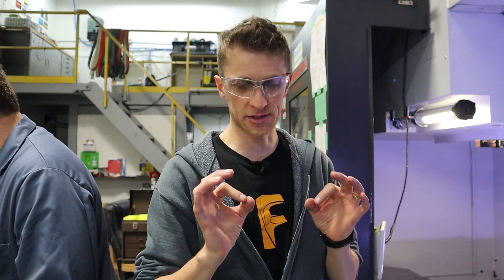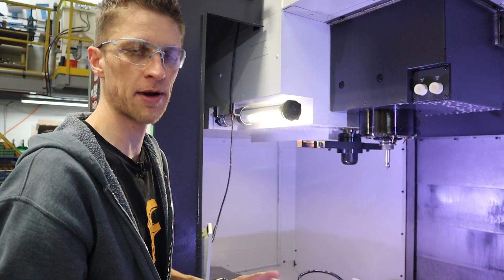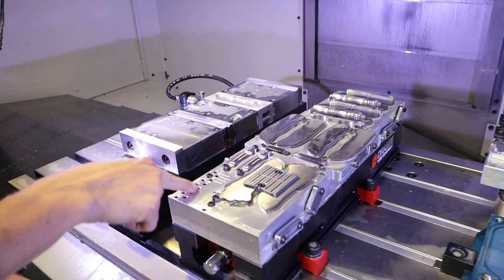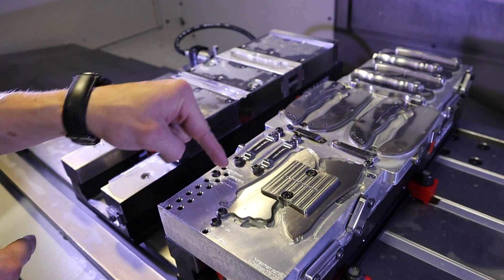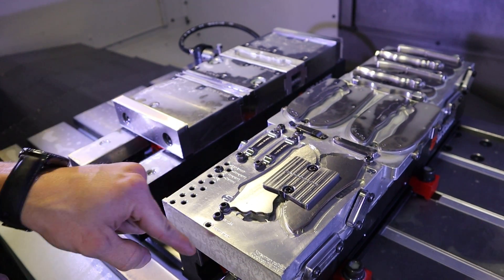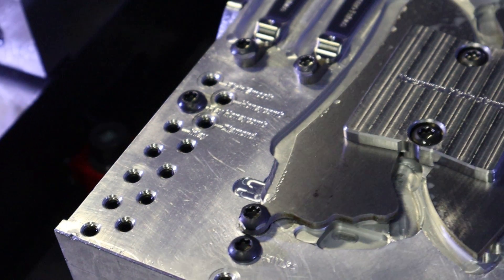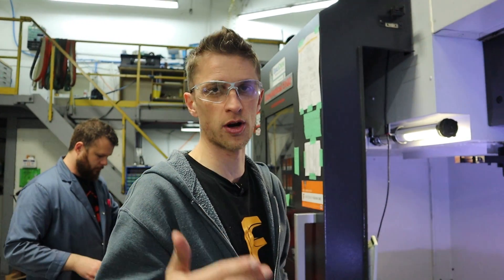Another macro I've been wanting to do for a super long time — I finally came up with it a few weeks ago and it's been awesome. When we machine our knives we have five different patterns that we switch between all the time. I used to have five different codes; now it's all built into the same fixture with drilled and tapped holes. The probe comes in and goes nope, nope, oh there's something there — makes that a variable one, then skips the rest. It moves to the blade steel and goes, oh, RWL34 — I know I need to do that because the codes are slightly different for a damasteel blade. This lets the operator, the pallet filler, choose what pattern to make, and the code does everything else. It was complicated to set up but all the work up front means it works awesome.